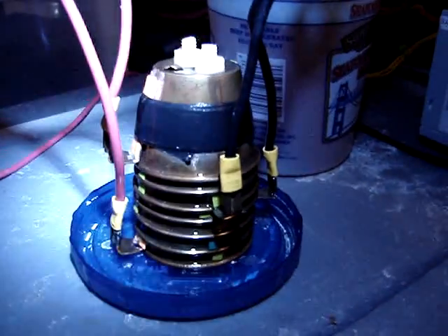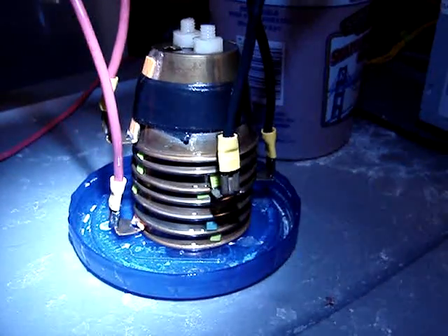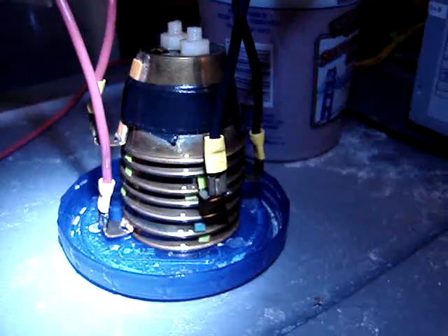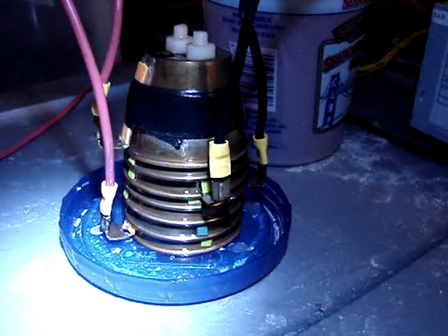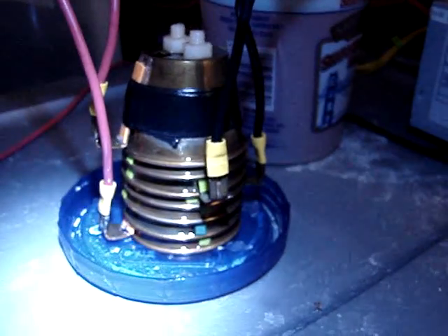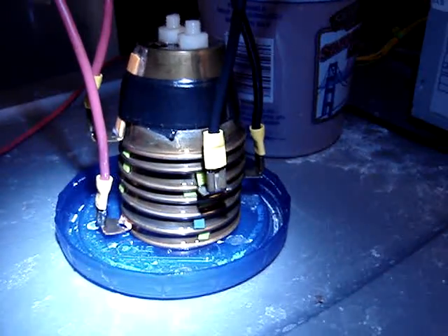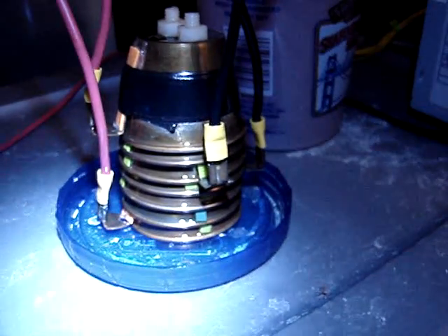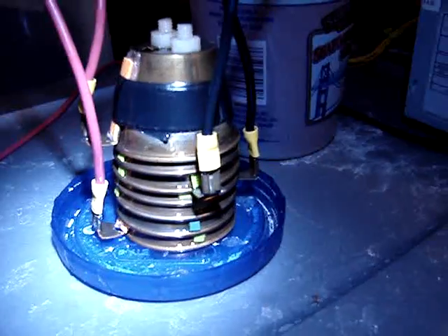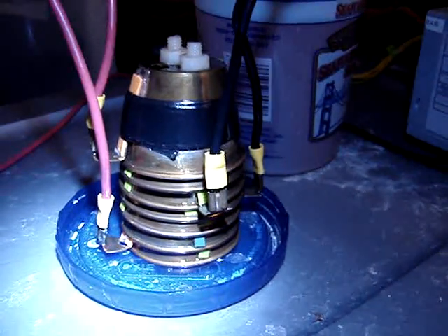It's basically a seven cup, seven stainless steel cup, two and a half ounce cup. You can buy four of them for a dollar over at Walmart. I've seen a lot of other videos where people were using stainless steel cups, but they had them upright and all the bubbles were coming off of the sides and it looked like a lot of the bubbles were getting dissolved back into the water before they could even make it to the surface. So I thought, why not just turn it upside down — and by turning it upside down, create stages and chamber the gas, because it's being created in between each one of the cups, and force it from one stage to another, to another, to another until it gets to the top, and drill out holes on the top of each one of these cups so that you could basically use them as exhaust ports. And that's kind of what I did here.